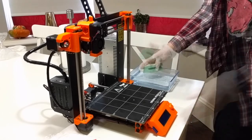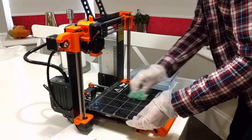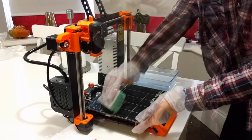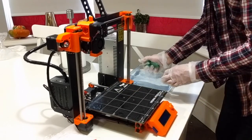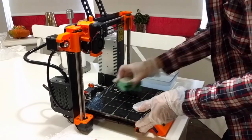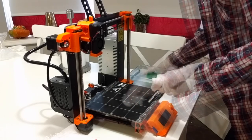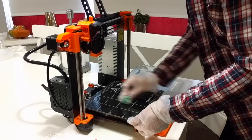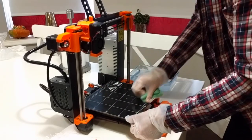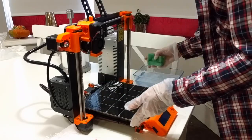Now, importantly — water, a fair bit of it. Use a plastic pan scrubber, not a metal one. Keep replacing the water and be thorough. I suggest you overdo this and spend some time on it, because any limonene left will evaporate when you heat the bed up and cause bubbles between the heated bed and the PEI sheet that don't go away. Keep iterating — every time you find something that isn't perfectly clean, attack it with the plastic pan scrubber, then rinse again with fresh water.